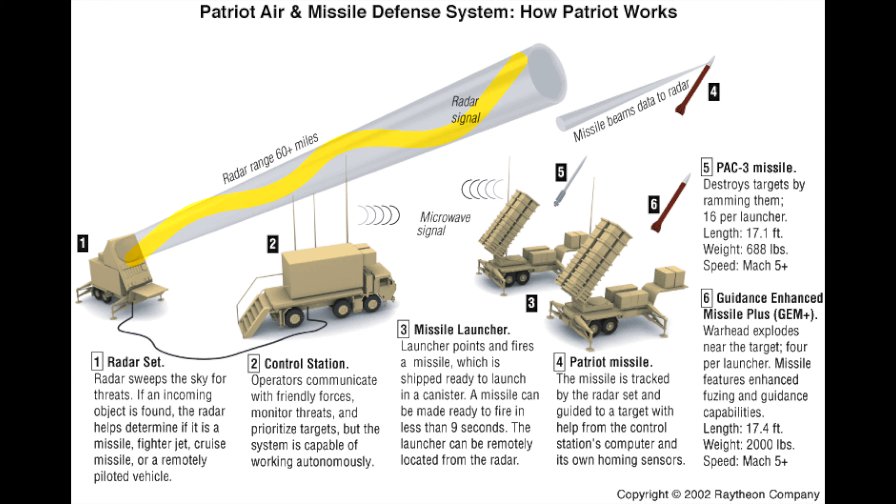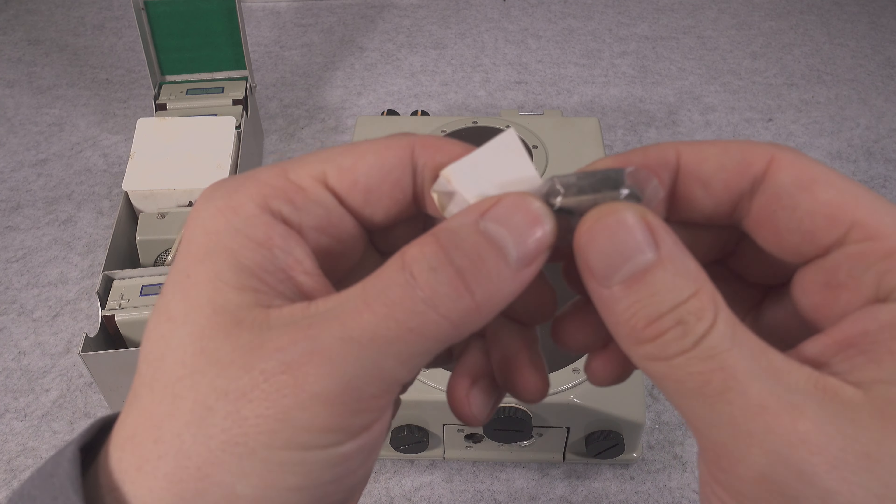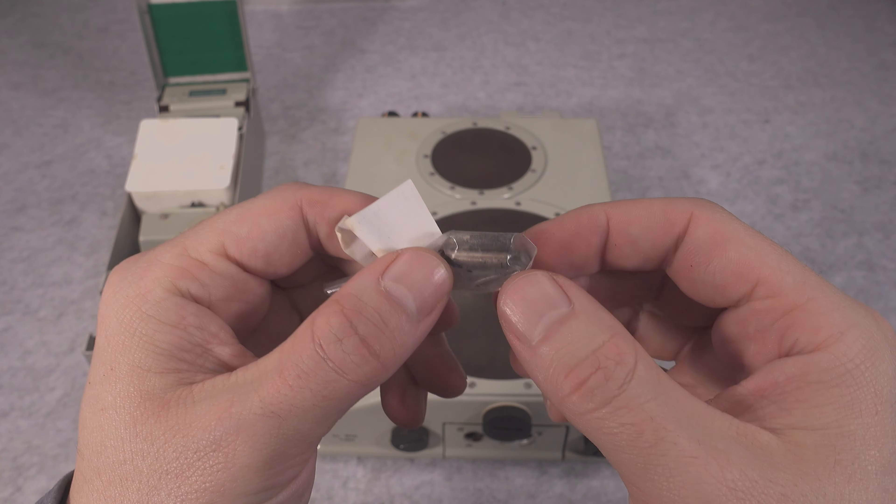You are going to grab the scale and insert it into that spot. Under D1, we've got a holder for our detector diode — you unscrew it in exactly the same way as a fuse holder, then insert your detector diode. As you can see, it is extremely similar to a fuse holder. You insert your detector diode and screw it in. There's another one for a different band.